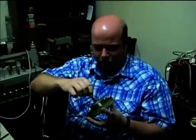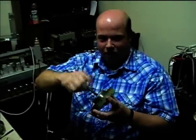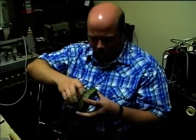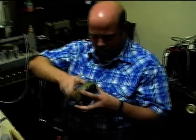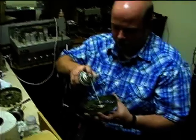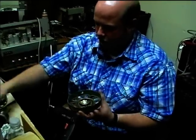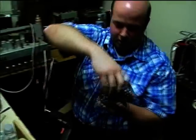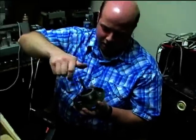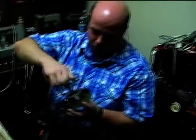I've improved it some here because before it was totally locked up in this rear bushing. Now it's running fairly freely. Just put a little bit of oil on here — I've got some LPS2 penetrating oil — and reassemble it. This may still need a new bearing, but we'll see how this might work. Put the motor back together.